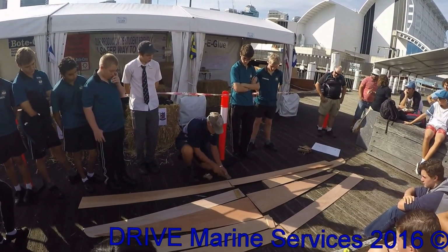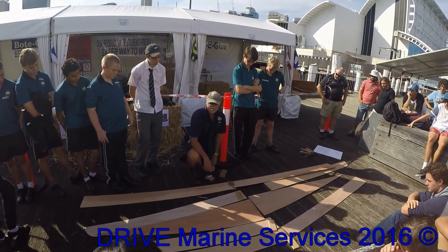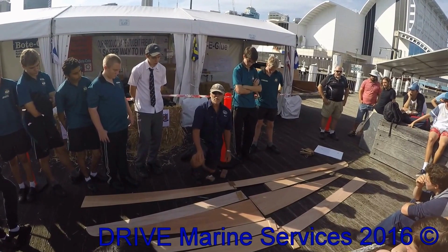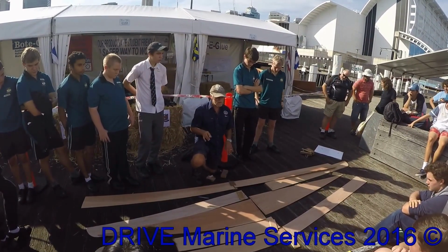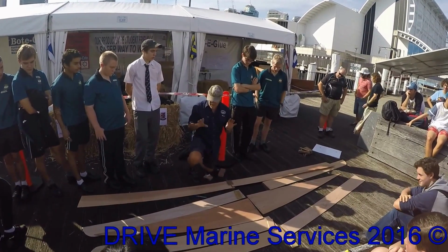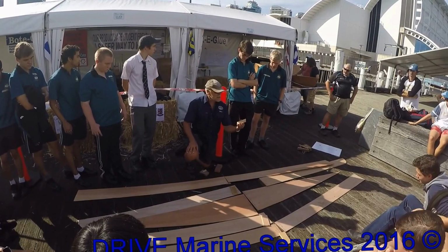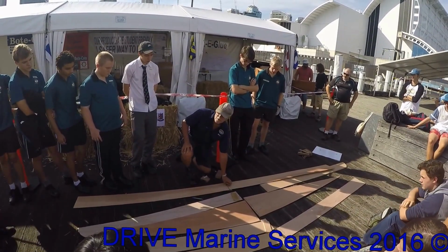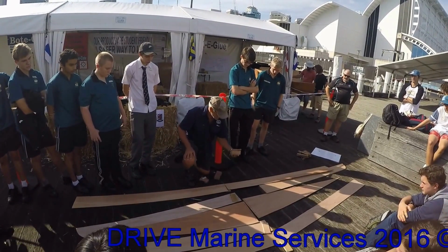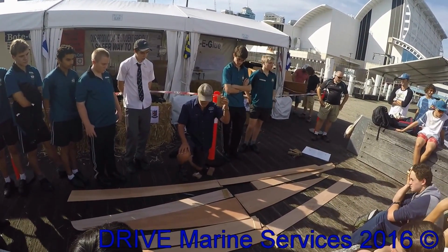When we're putting this on, it's going to go down low. Does anyone know why that gap's there? Okay, because we're going to put the gunnel or the gunwale on there, and it'll be in our way for the moment. But I'll make sure I come around to you before you actually glue this together. We don't want that stuck to the canoe, so we're actually going to put some plastic underneath it. All right? So the outside, see the scrappy ply? You don't want that on your canoe, do you? So you're going to put some plastic.